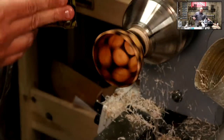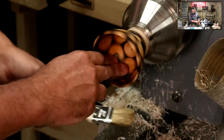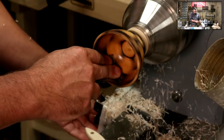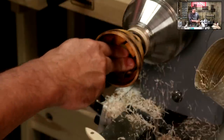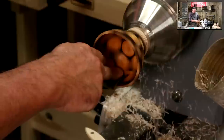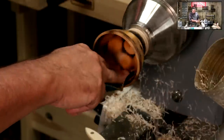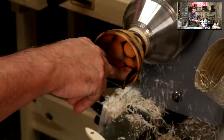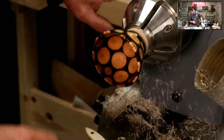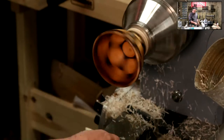Let's get a brush to apply this. A bit more oil required. The timber sands fairly quickly. It's the resin that takes the time. I'm not pushing too hard. I'm purposely going through it a lot quicker than I would do, though, so bear that in mind. You will need to sand a lot longer than I'm sanding here.